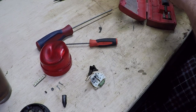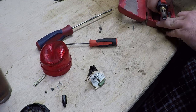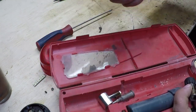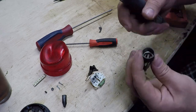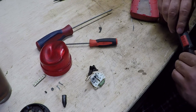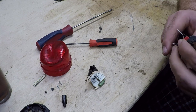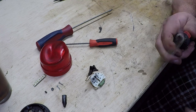Here's the little handy-dandy Snap-on butane soldering iron, which I love. If you guys need portable heat for soldering, this is your guy. We're going to put the tiny little pencil tip in it, and we're going to solder stuff the size of, well, maybe 28-gauge wire. I couldn't find my good solder, of course. Okay, that's getting hot.